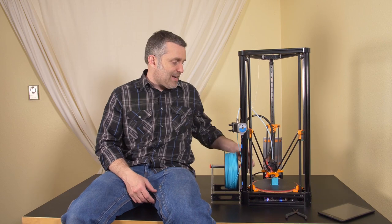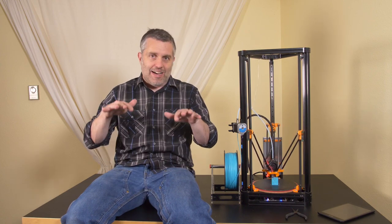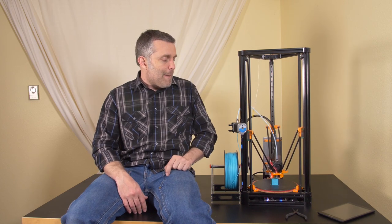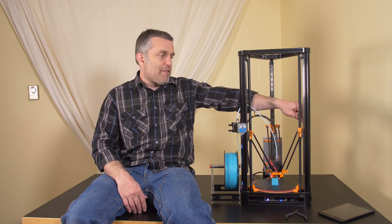So it was like grinding along this edge of the bed, and along that edge of the bed, it was floating up in the air. And I still don't know what's causing that inaccuracy. It could be a crooked frame. These plastic joints here are pretty suspect, and in fact, there are kits that you can buy with metal joints. But it also could be the lash, the wiggle that I'm getting out of the bearing blocks on the linear motion guides. Project's done. It's a good one.